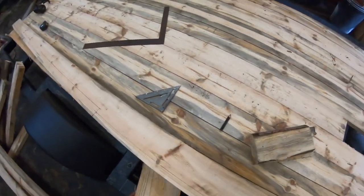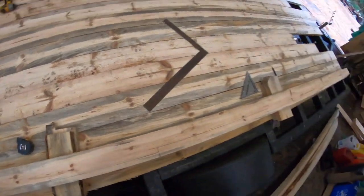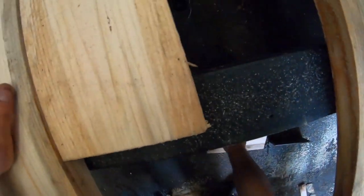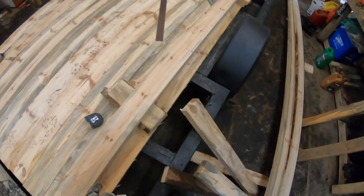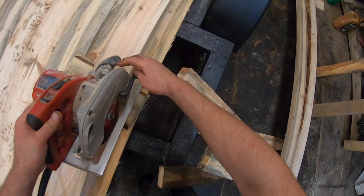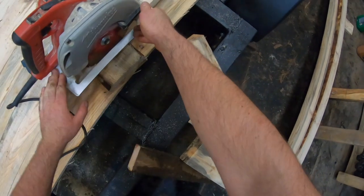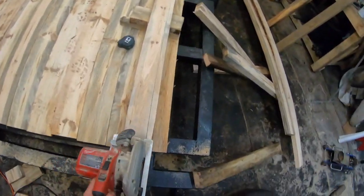A little bit of fancy cutting coming here, but we'll make the best of it. You'll see why I have to do all this — basically it's because of the width of the material I have. I'd rather use what I have at hand than go out to the bush and make more wood. There's no point having that entire depth of blade going when there's only an inch and a half of material to cut. So loosen off your blade adjustment, set it on something like these blocks, lower it down, and lock it in position. That way it's safe and you don't have so much blade sticking out the bottom.